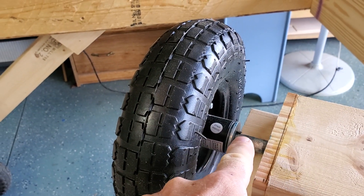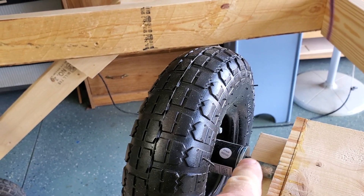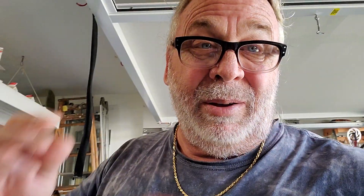Just wanted to give you a little tip on how that axle was done. I did have to scuff up the five-eighths galvanized grounding rod a little bit with my sander, because it was a little bit of a tight fit. I needed to get it ground down a little bit so it would actually slip into the bearings.